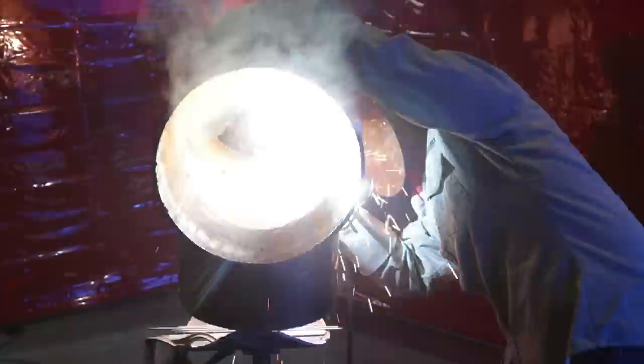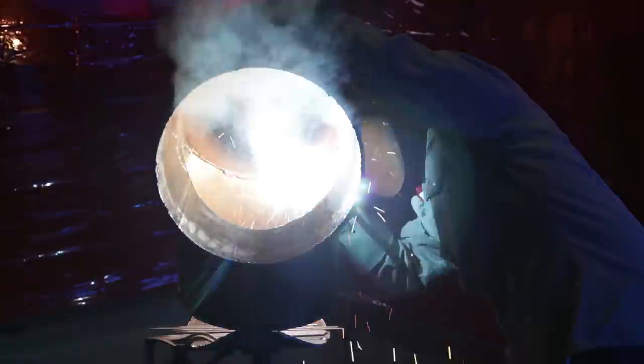Now you'll see how it's hitting both walls. It's just going at a good pace, pushing that rod in there, man. Important, pushing that rod, and also having enough bevel that you can push that rod in there. That's why it was important when I told you about putting enough bevel on that saddle, okay?